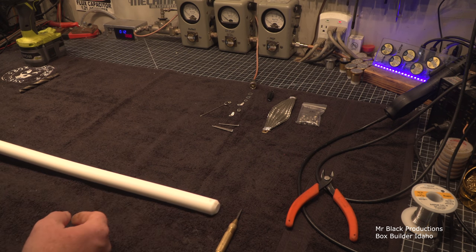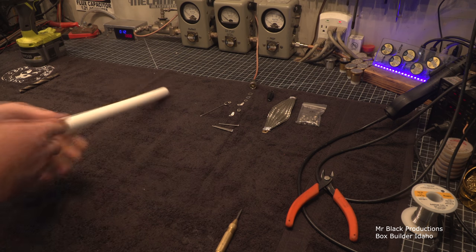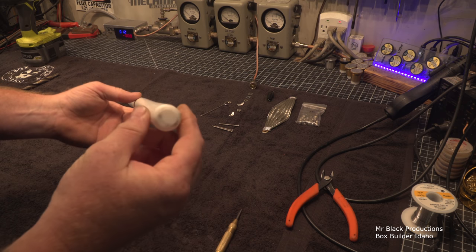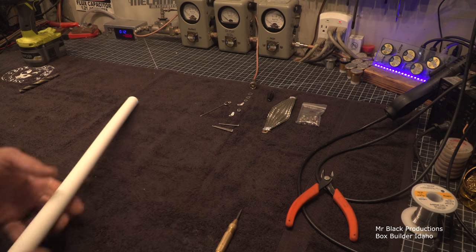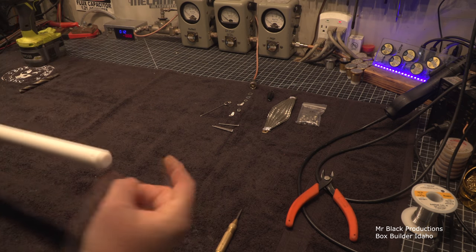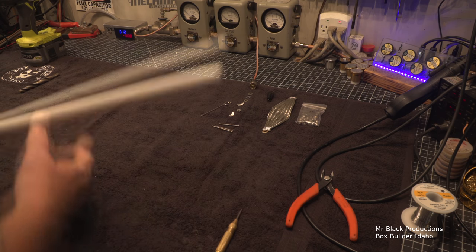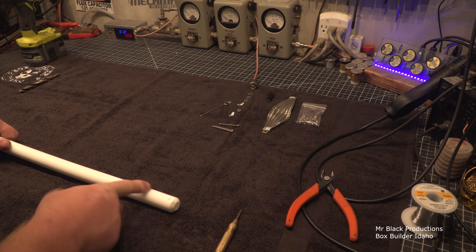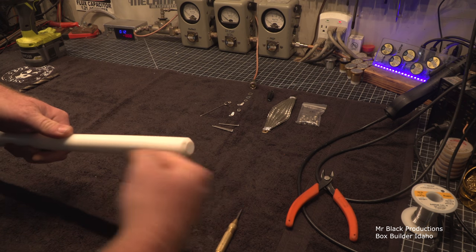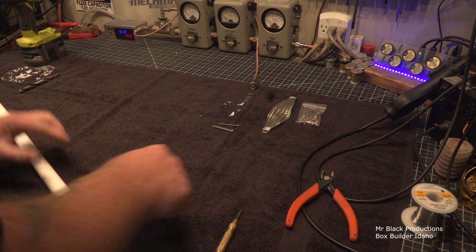So if I wanted to almost double or triple the kV rating of this rod, now please note this is an extruded piece of Teflon and it's not perfect. I mean, you can see it, it's not perfectly smooth, right? Not perfectly straight. So put it in the lathe and we'd have to put a follower, drill a little tiny hole here and put the lead on it, and put ribs in it. Increase our surface area. Because remember that electricity doesn't want to go through the solid plastic. That's hard. Let's take the easy path and go over the outside. Okay.